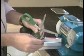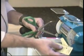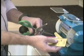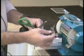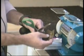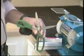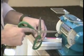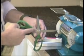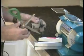We're going to start off by either matching the angle of the scissor with our angle gauge that's supplied with your Twice As Sharp, or we're going to do a scratch test on a scissor and match the angle. Or another way to do it is you can just sharpen an angle that you've determined. At Wolff, we sharpen all of our corrugated industrial scissors at 25 degrees on the thumb blade of the shear. You can see the clamp right now is set for 25 degrees.